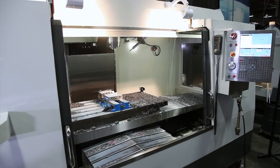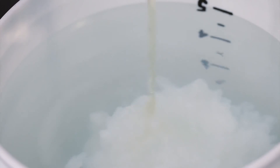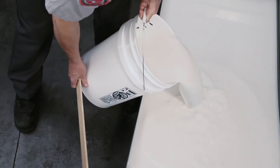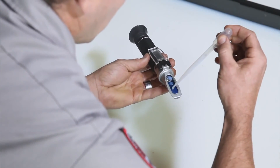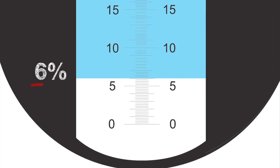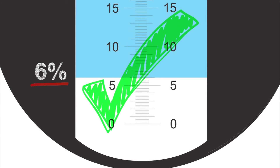Unfortunately, this machine has been using a concentrate that does not emulsify very easily. So, once again, we will make 1% buckets to fill the remainder of the tank. With the tank full, we can take our reading. Despite using 1% buckets to finish filling the tank, our refractometer still displays a value of just above 6% brix, meaning this one-to-one ratio coolant also has an actual concentration of just over 6%.